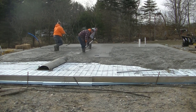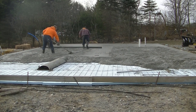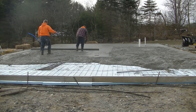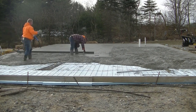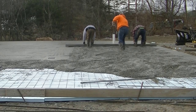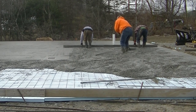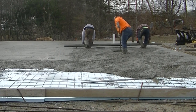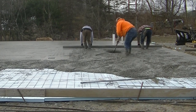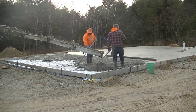That wet pad slopes about an inch and a half up to where we've already screeded. We generally always hand screed slabs or floors when we have a slope, so that's why we're hand screeding this and not using the power screed today. For pouring in freezing cold temperatures — and it is freezing cold, my fingers right now are numb, I can't even feel them — the screed is cold, the rakes are cold, the bull float's cold, all that metal we're using is really cold. So every time you touch something, the fingers just get colder and colder.